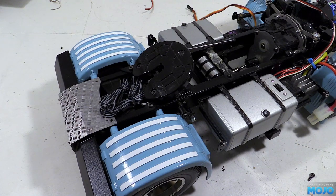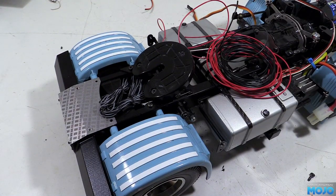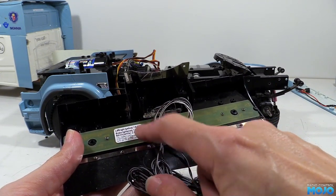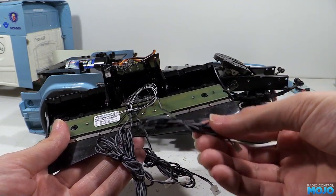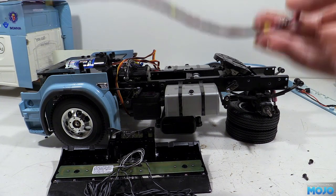Next, at the back we've got the wiring for the bumper to sort out. I'm not going to be going into super detail in this video — that kind of thing is going to end up being live streamed over on twitch.tv/rcmojotv, hopefully with the complete streams available to watch on demand. On the PCB there's a sticker that suggests using a 100 ohm resistor when powering from 5 volts, which given the parallel LED wiring is a bit of a compromise but it'll be okay if a bit dim. From the PCB there's lots of wires which we don't really want to trail along the chassis, so I've made a little board using some strip board.